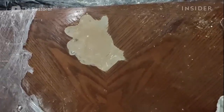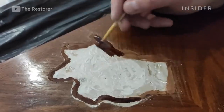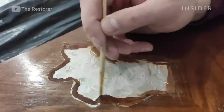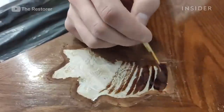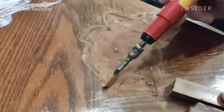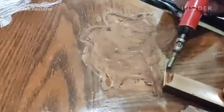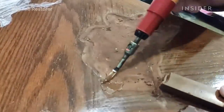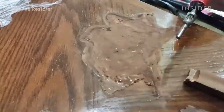To start adding color back into the repaired hole, he uses a mix of tints and furniture wax that he's color matched to the original wood tone. He starts around the perimeter and works his way into the center using a nozzle and gas soldering iron, which melts the wax onto the damaged area. The wax helps to restore and fill the color of the wood veneer. He finishes this repair by leveling the surface with an abrasive restoration fiber.